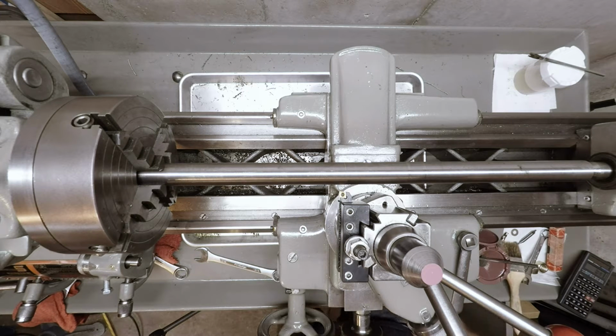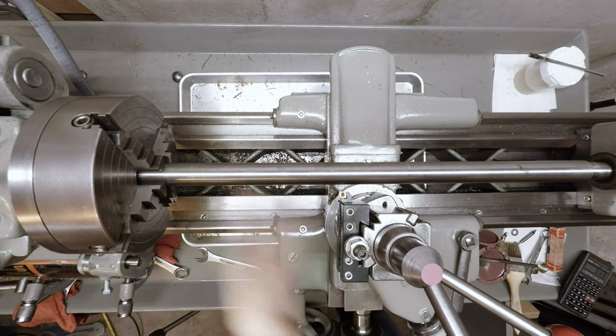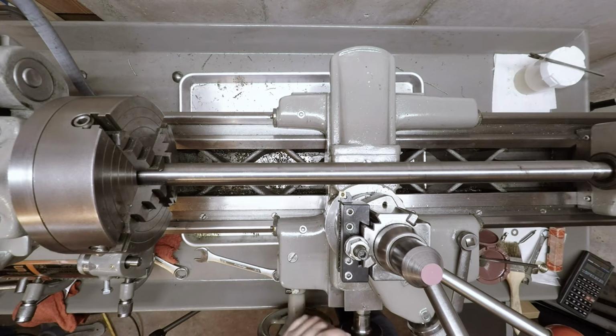The barrel diameter throughout the length is 908 thousandths, and the rear sight block journal that we need to turn down to is 887 thousandths, but we're adding 2 thousandths to it for a press fit, and that'll get me to a point where I can kind of massage it in where we need it. So for right now, we need to take off 19 thousandths.